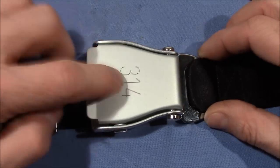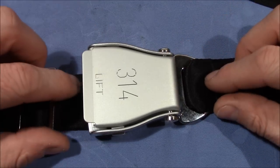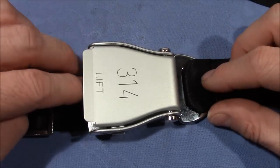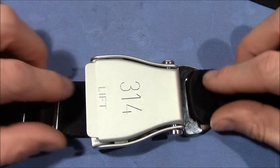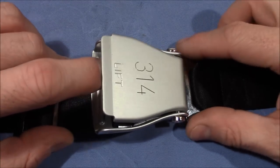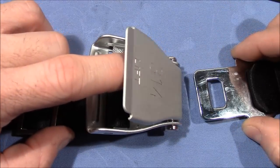They designed it this way because you don't want to open this mechanism by just pulling a little bit on the handle. So it should not open right away, but it also should not flop around. There's a spring-loaded first part of the movement which doesn't open it, and then a second part which needs much harder pulling to actually open it up.